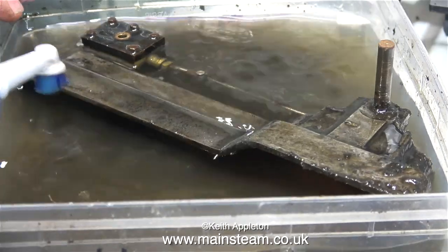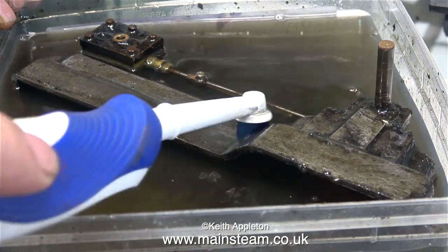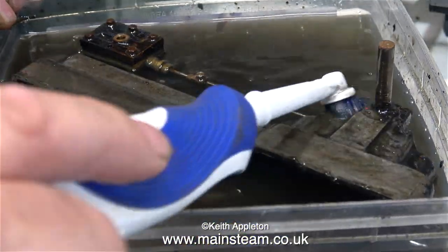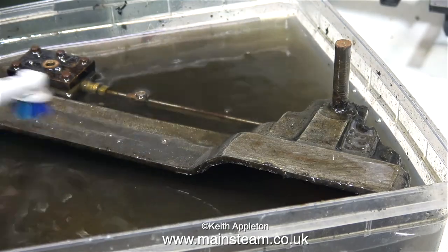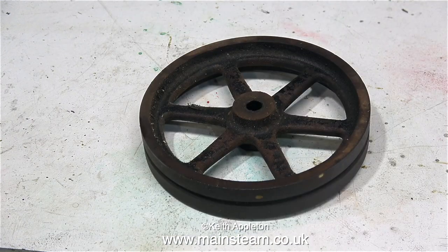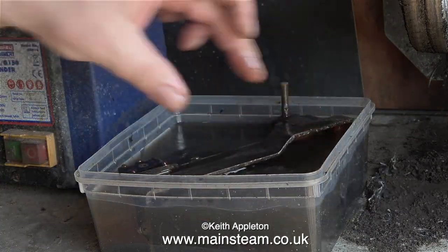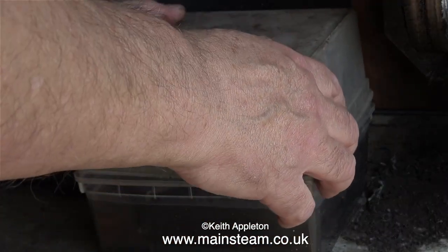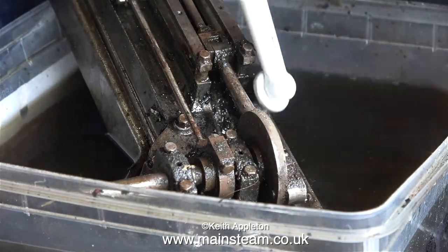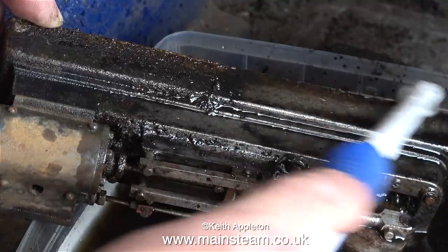When I first tried out this electric toothbrush idea I wasn't sure whether it was going to work, but I wasn't using any solvent. You definitely need some kind of lubricant — if you use it dry, all it does is spread the grease and grime over a different area of the model. As I've mentioned before, if you're going to buy one of these electric toothbrushes, buy a more expensive rechargeable one because the batteries don't last very long. This is the rusty flywheel — most of the paint seems to have gone anyway — so I'm going to put this in the tub with the engine, and now in the outer part of the workshop I'll leave this for 24 hours, using another tub as a lid to stop it evaporating. The next day it's time to clean it up. It's been in the cellulose thinners for 24 hours so all the grease, grime, and paint is very loose and it's coming off beautifully with the toothbrush.